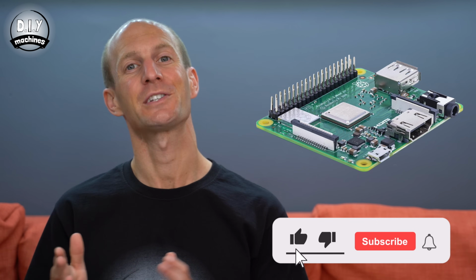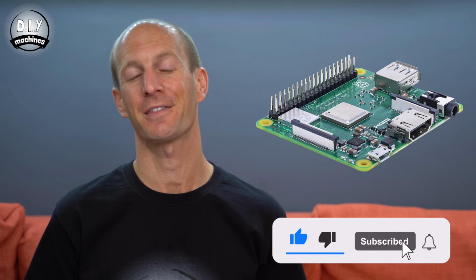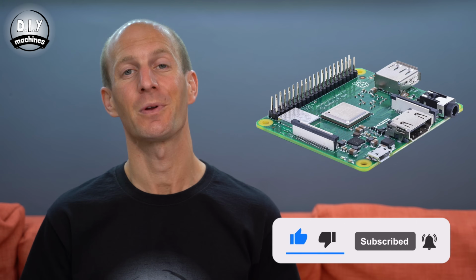Let's add our Raspberry Pi next. Now the Raspberry Pi is going to be responsible for feeding the G-code instructions for drawing out the patterns to our Arduino Uno line by line. For this, we're going to install a program called Octoprint onto our SD card.